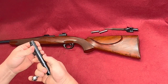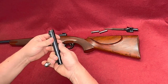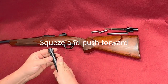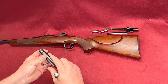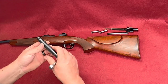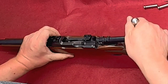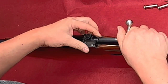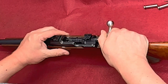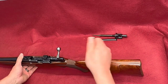We're going to remove our extractor. On a Mauser it's nice because you turn it past the top of that groove and squeeze on the extractor and it pops off. We'll leave this on here — too much stretching makes the bolt bind a little bit, so unless you have to take it off, I don't. You do want to make sure that when it comes through this area it doesn't rotate, because it can get stuck in there. So we have two gauges.